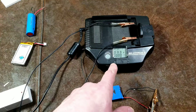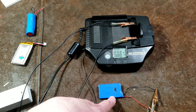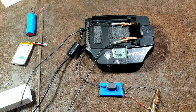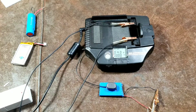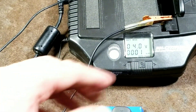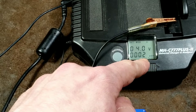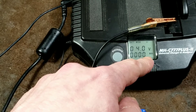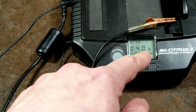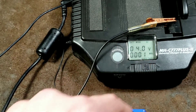It would take a huge amount of time. Literally this little battery might take this charger an hour to charge. So you do something like this and just set the little temperature sensor on top of it so you don't have a fire. What I also kind of liked about this is it's counting off how much charge it's delivering as well as counting off how much time it's taken to charge. And this voltage is how much juice it's actually hitting the battery with. So it detected it as lithium-ion, knew it was a single cell, and it's hitting it with four volts.